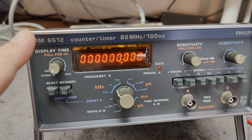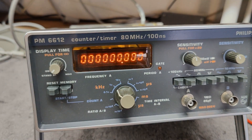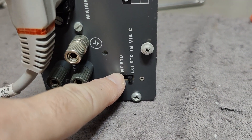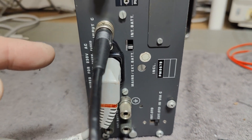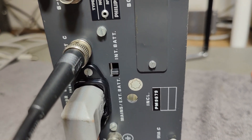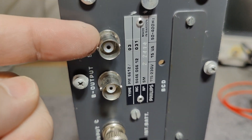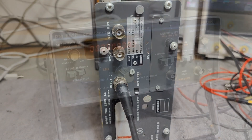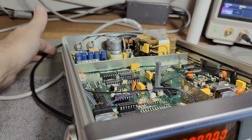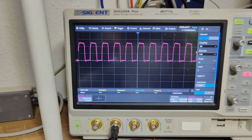I'm quite happy at least — we got light in the VFDs. There's a switch at the back that says internal standard or external via input Z. It can run on a battery via the B input, and that will be the standard output. I could also just measure the frequency standard right there. The standard output I connected to my oscilloscope and we can see 10 MHz from the oscillator.